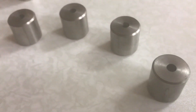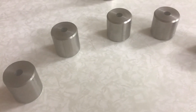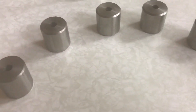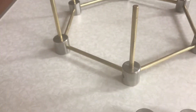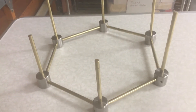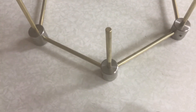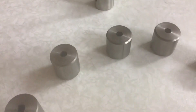I've made six of these blanks, one inch high, and they turned out to be within three thousandths of an inch to the correct length — not critical, but fun to aim for. I'm making a hexagonal structure and need to make a second level. These six nodes should be identical to the first ones. The vertical hole through the center is already done, so now on these blanks...